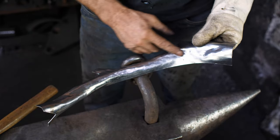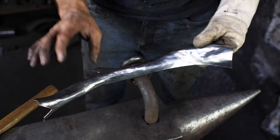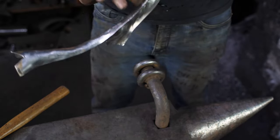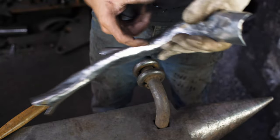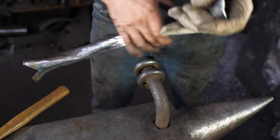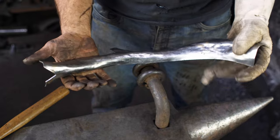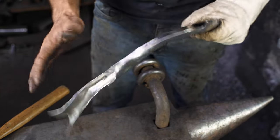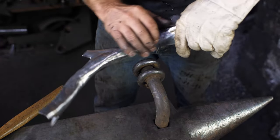About 10 minutes into the inside curve of the antler and this is by far the trickiest one. It curves both this way but also has a wrap around this way, and steel does not want to do that. Think about paper - it's the same sort of principle. It certainly does not want to do those two divergent movements at the same time. So quite tricky. After about 10 minutes of working this piece cold, I'm going to heat it up to anneal it, get it a little softer and see if I can coax it around.